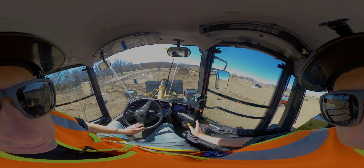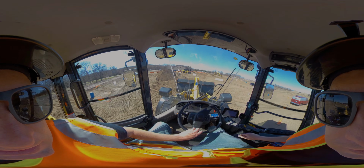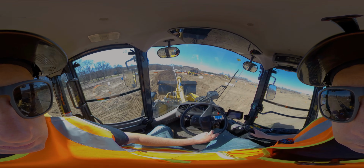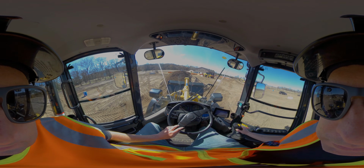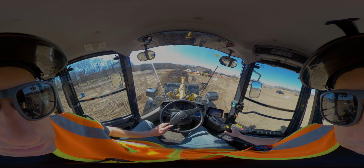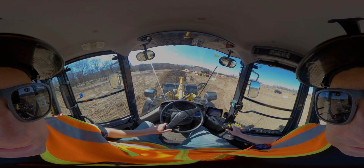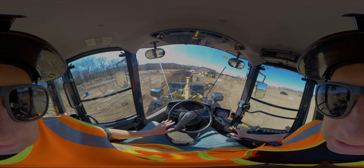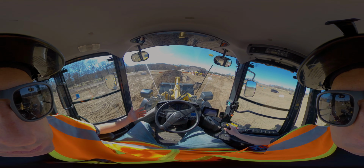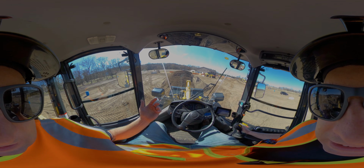So I'm going to come forward here. We're using our mount here. Generally want to be pretty straight up with this. Now this is where I'm going to open my bucket. Now for us, you're looking at the top of the bucket. I have red lines on ours to see it, but you generally want to see what the blade angle is. You're not going to want to go in curled up. You're not going to get a scoop. And then we bring it down. Usually I recommend actually being off the ground.